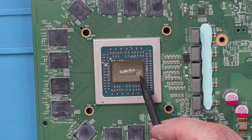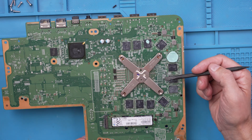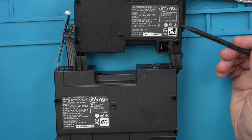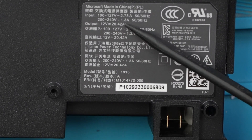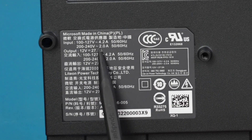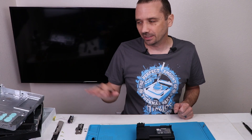Now that it has the perfect amount of thermal paste applied, we can get to the reassembly and repairs. One other thing I'm curious about — with all this extra RAM, theoretically this board is going to use a lot more power than the retail version. So let's check the power supplies. The retail version outputs 12 volts at 20 amps, while the developer version outputs 12 volts at 27.5 amps. So the developer power supply puts out significantly more amperage — which makes sense given the extra RAM and computing power.